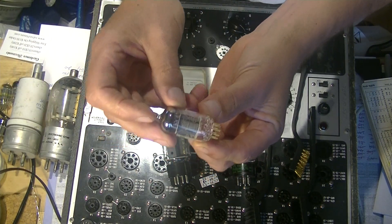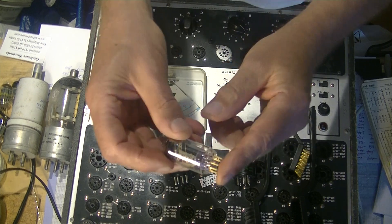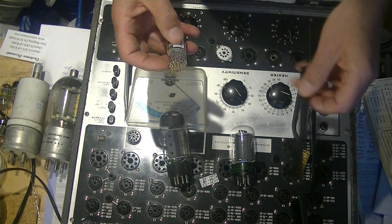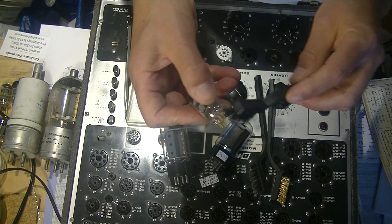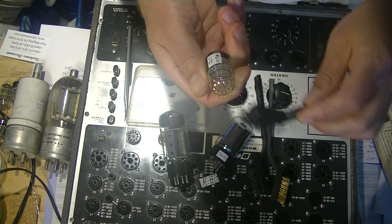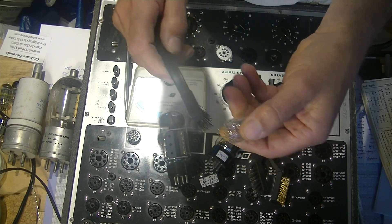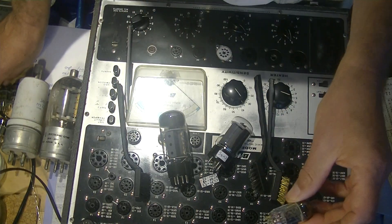Here's a little signal tube with beautiful gold pins — this is an ECC83, the European version of the 12AX7. Look at the gold plating. There's absolutely no need to scrape it, and definitely no need for stainless or brass brush. If the gold is looking very dull, you might just dust it with a nylon brush — once or twice around each direction. Look at that, it's coming up nice and polished. That is just a very thin electroplating on there; you do not want to be aggressive or you're going to lose all of your gold.